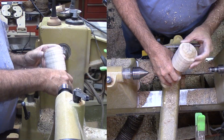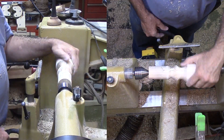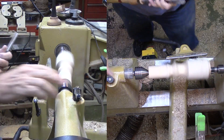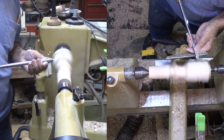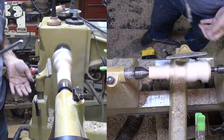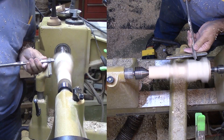This time, I don't want a hollow. Instead, this is a large smooth bead running from the last hollow to the base. With the convex surface, I can risk using the skew to smooth out my cuts before sanding this section.